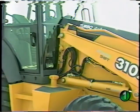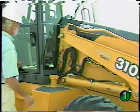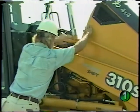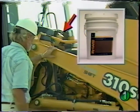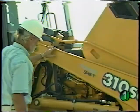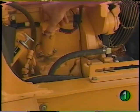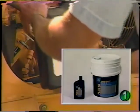Daily service continues on the right side of the machine. The hydraulic oil level sight gauge is conveniently located just back of the tilt hood for easy ground-level viewing. Oil is added through a fill port accessed under the tilt-up hood. Fill with John Deere High Guard transmission and hydraulic oil or equivalent. With the hood tilted, the engine oil dipstick can be accessed. Engine oil is added through this easy-access fill tube, designed so you can easily add oil from different size containers, even large ones. Fill with John Deere Torque Guard Supreme or Supreme Plus 50 oil or equivalent.